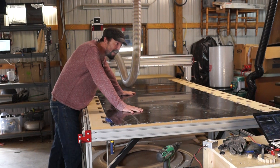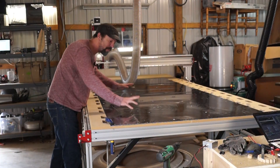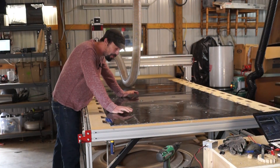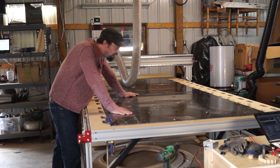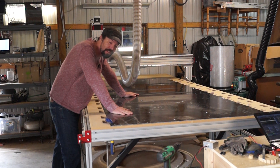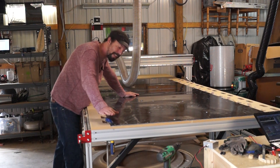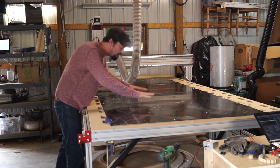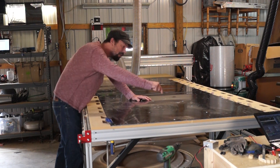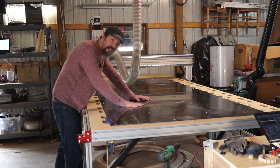Here's the situation. I need a whole bunch of aluminum pieces that are about a little over three feet long. I bought this four-foot by ten-foot sheet, and it just happens that if I lay everything out just right I can cut all the pieces from it. The problem is it's 0.04 inches thick, which means it's flexible and I have to hold it down somehow. Simply clamping it on the edges isn't going to work — it's flexible enough that the center would rise up, and every piece I cut out makes it more flexible.